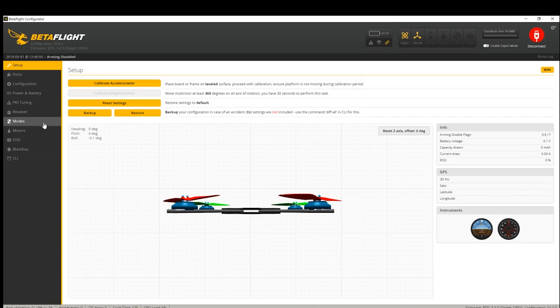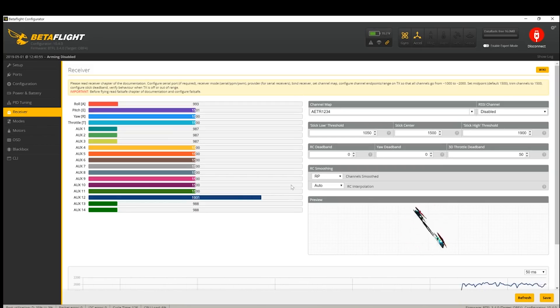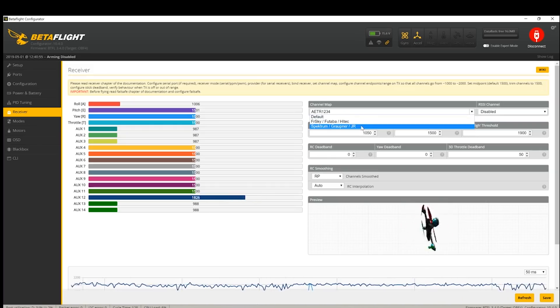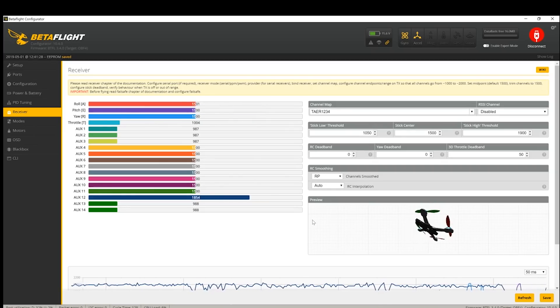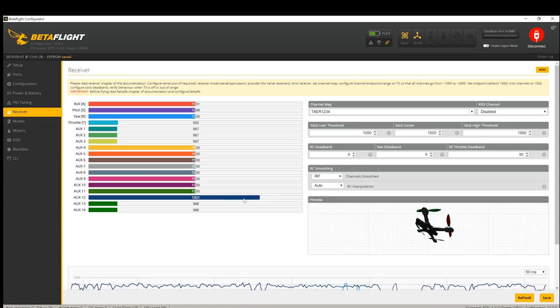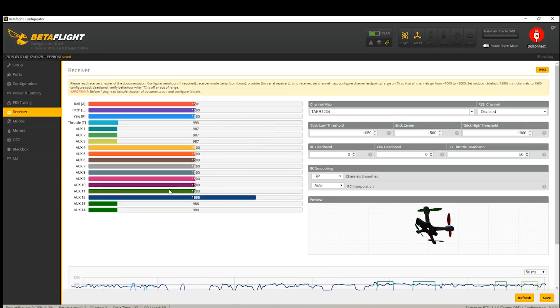Connect again, make sure my radio is turned on, go over to our Receiver tab, and I'm going to plug in a battery into my drone. You can notice my drone is going absolutely crazy and that's because our channel mapping is a little bit different. If I move the sticks it's not really doing what I want. Going down here - you'd think it would be FrSky, but that's not how it actually works. I have to select Spektrum. I'm going to click Save and then look at that - I move the sticks, there's my throttle, there's my yaw, my pitch, and my roll. They're all set up, and the switches I set up before are enabled as well. As I flick auxiliary one, auxiliary one goes up - auxiliary two and three as well.